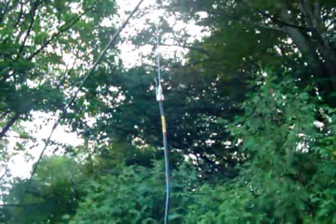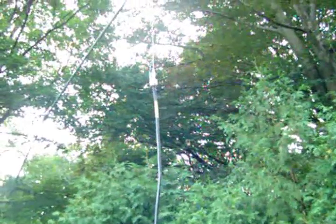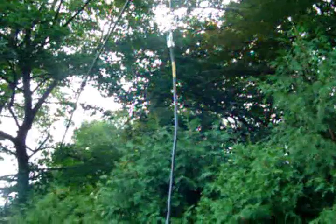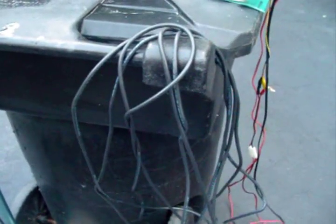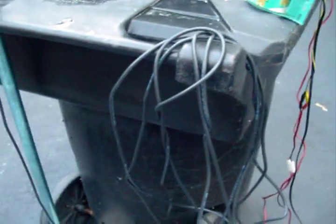Direct fed using alligator clips. I have to buy SO-239s — I can't find any decent quality ones locally, so I'll have to do an online order. I've got that running down coax into a really home-brew backcountry balun or something. Because if the coax just lies on the ground, the SWR is really bad. I need a balun — yes I do.